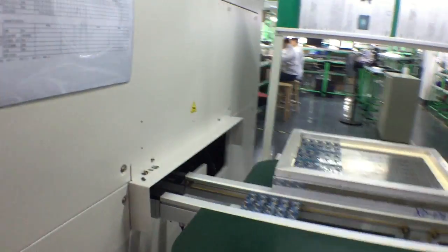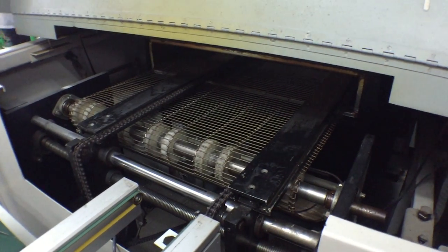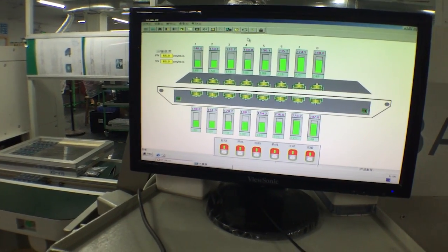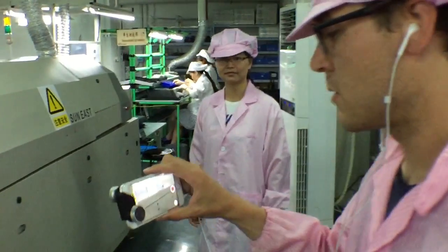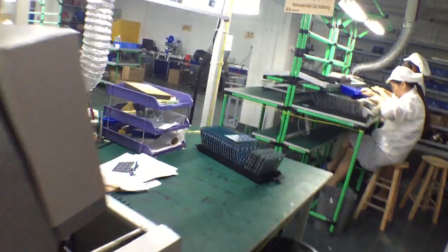It comes out this side. You can see a completed board right here. They're going to go into this conveyor belt, and the board comes through this long oven — fed through on a conveyor belt with many different heating zones. Instead of having an oven that changes temperature really fast, you have a really long oven with many different temperature zones that the board goes through, and it cooks as it goes through. The boards come through the reflow oven and come out the other side.